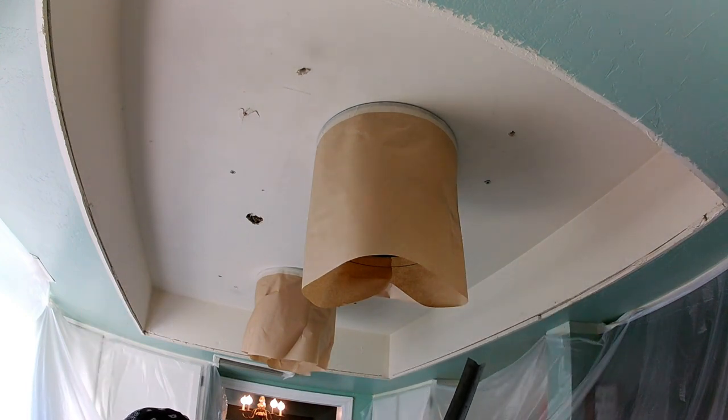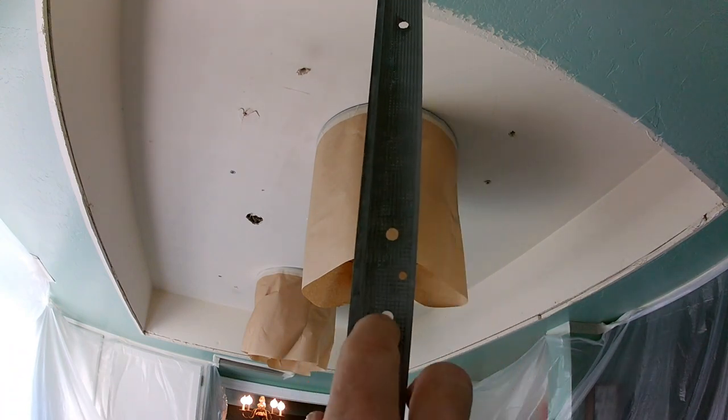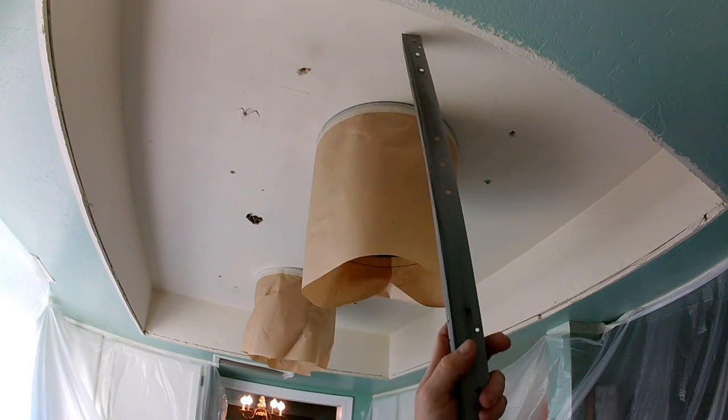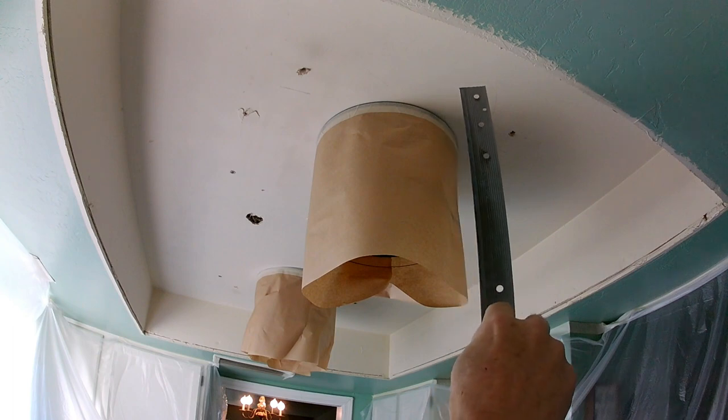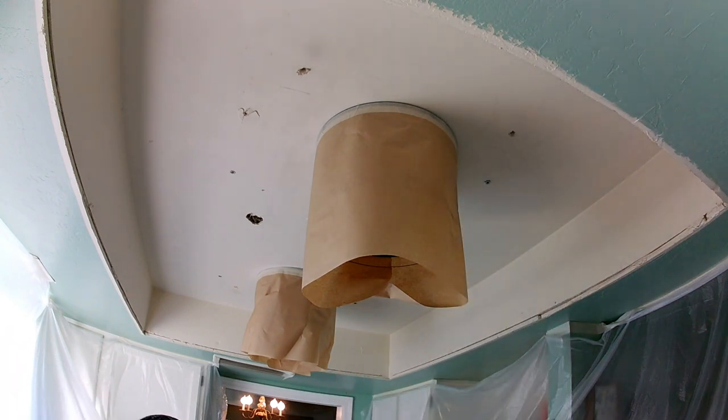A lot of guys like to install corner bead with nails, hammer and nails, but I just like to use screws. Screws and nails, you notice in the corner bead there's holes, holes, holes. I like to start on the outside hole, these smaller holes, and I start on the center of the bead and then work my way on each side. So you need your screw gun,